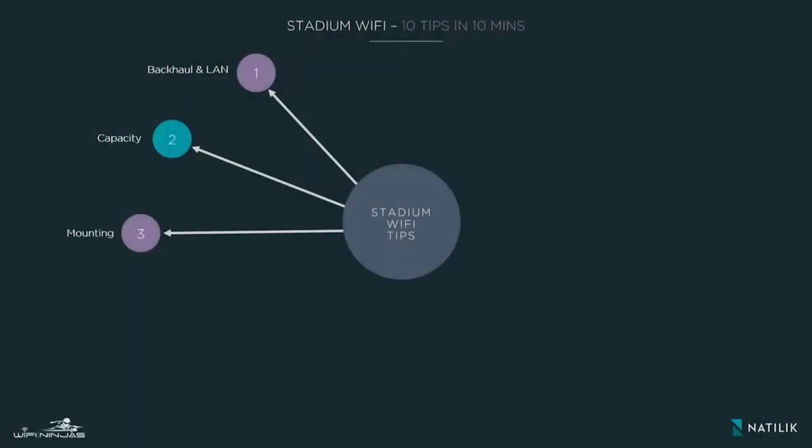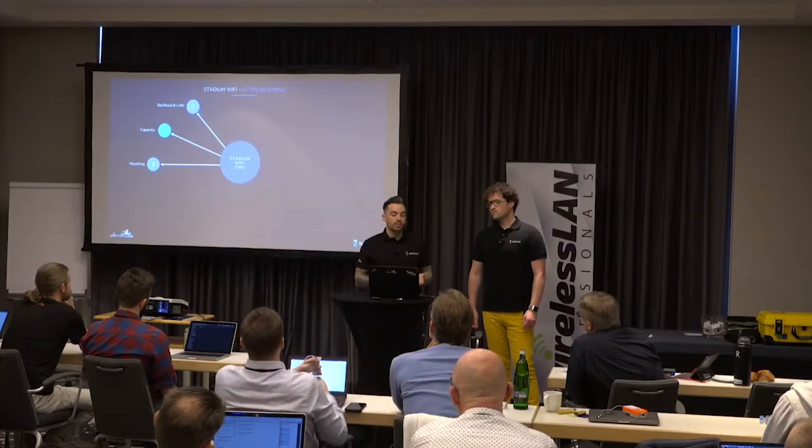Let's move on to mounting. There are a few different options when it comes to stadium Wi-Fi mounting. Usually you want to try and aim for shooting from above. Sometimes people will shoot from behind, sometimes people will use rails, or in some cases there is under-seat mounting. What we recommend is that you do what we call a pen and paper survey — go around with an iPad and the floor plan and really start to get a feel for the stadium. Start to look at the infrastructure and think about where you would like to mount access points and where you're going to put the antennas to cover the different seating areas.